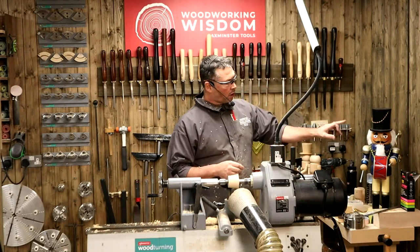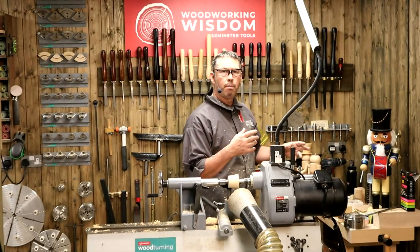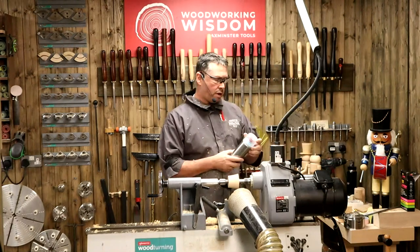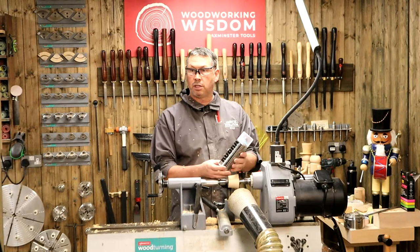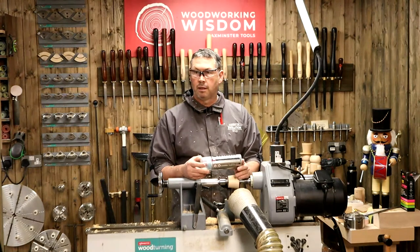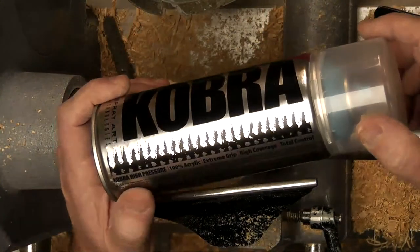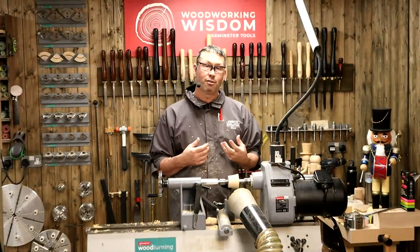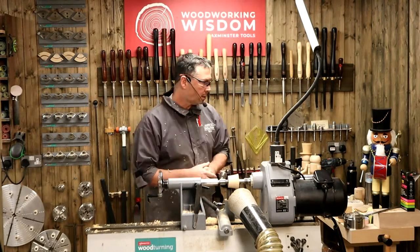If you are putting opaque colors on, like this one here, so that you can't see through to the grain, then I use graffiti art paints, or things like the ebonizing lacquer. My favorite brand of graffiti art paints are Cobra brand, and they're just spray. They're called Spray Art Technologies, and I'm probably plugging where I shouldn't be, but they're Cobra paints for graffiti art, and they're a single coat. Literally, I'll spray one coat on. I won't have to go over it again. They're so good. There's so much pigment in there. And the colors are really cool colors as well. They're not the boring basics. They are really interesting colors. So Cobra paints. I have no links to them. They're just my favorite.